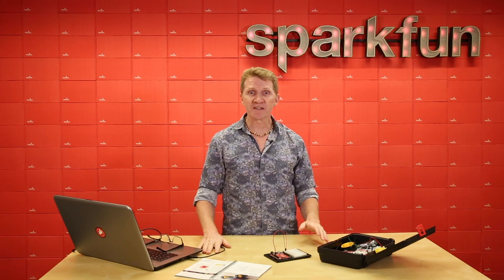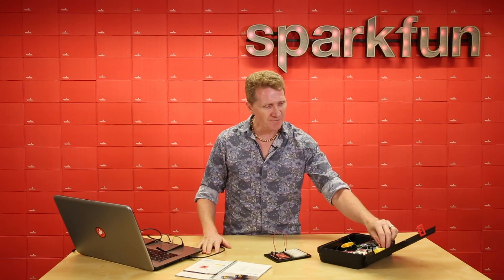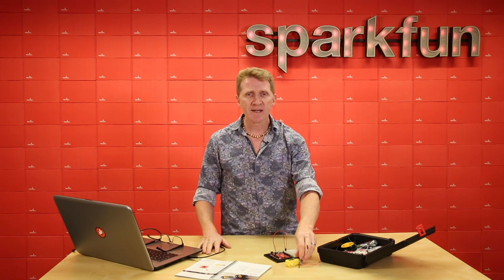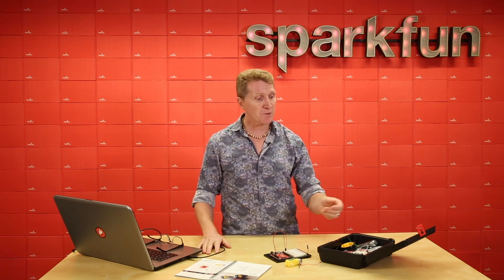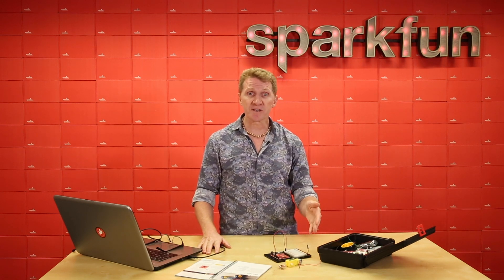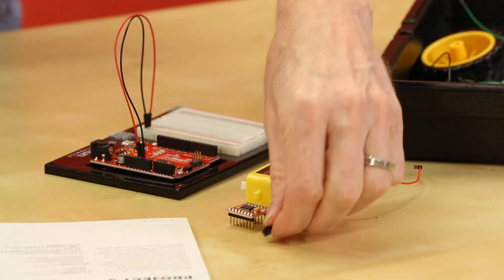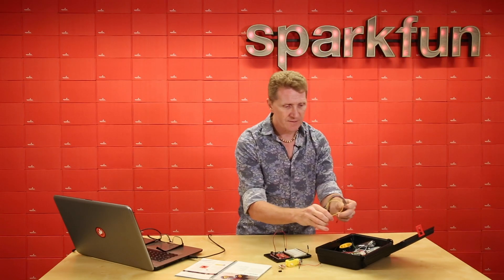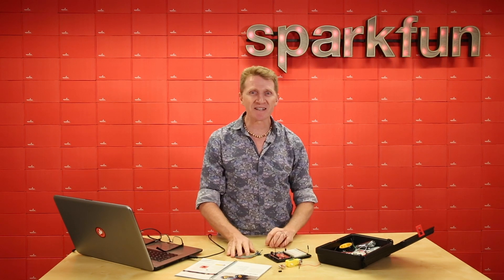Since we'll be making a robot that travels, our first circuit will teach us how to spin a motor. We'll need a few things: one of our motors — we'll just use one for now to learn how to get it moving. A motor requires a lot more current than we can output with the red board's digital pins, so we're also going to need a motor driver board. This will give the motor the current it needs and send the data to spin it. We'll also need a switch and 16 jumper wires. Grab all of those and we'll put our circuit together following the hookup guide in the guidebook.